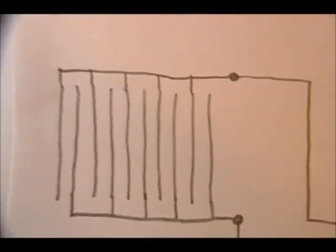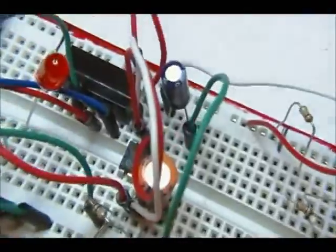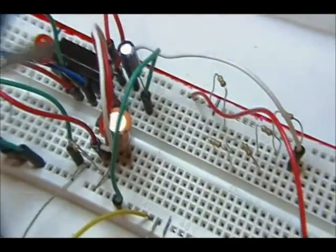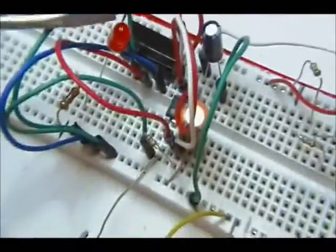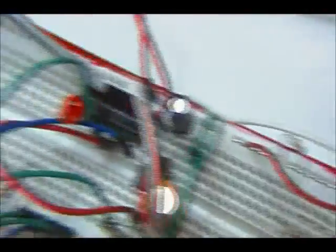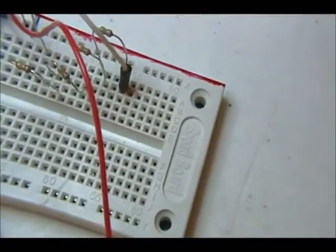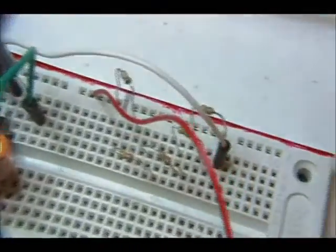The schematic for that is there. Very simple — that took like five minutes to make. And here we have a 555 timer right here. We have a capacitor — this is a 22 microfarad capacitor right over here, and this is a 1 microfarad capacitor. The LED I threw in across the coil of the relay. There is a relay — that's this little guy here. It looks like an IC, but it's a relay. I have this bunch of resistors, which I have all in series. They're one meg each, because I didn't have a five megaohm resistor. But if you have five meg, that's even better — you have fewer components on the board.